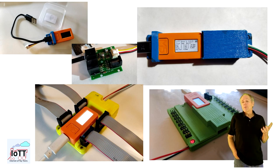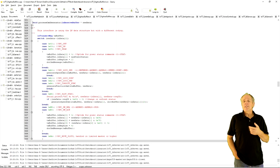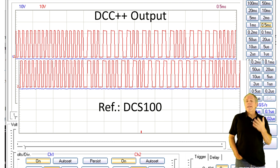When combined with a suitable hat, it can illuminate signals, set turnouts, or report button and block detector statuses. The only thing I never implemented in the stick is the management of locomotive addresses, even though I have kept a copy of the slot data in the stick memory for quite a while. So to add command station functionality, I just had to add code for messages that manipulate locomotive addresses and deal with local speed, functions, and consists.